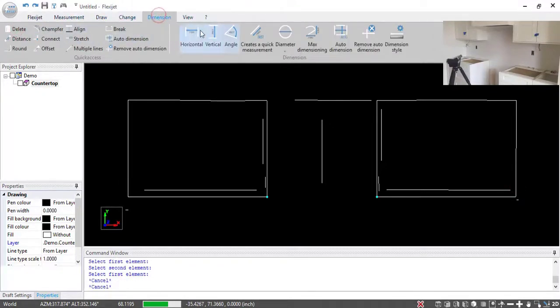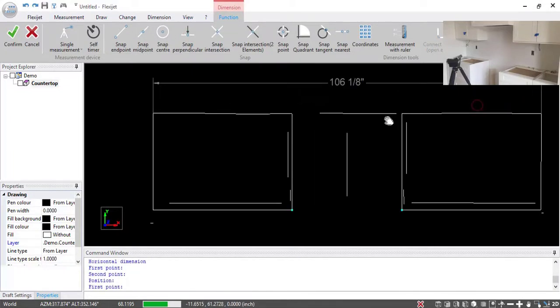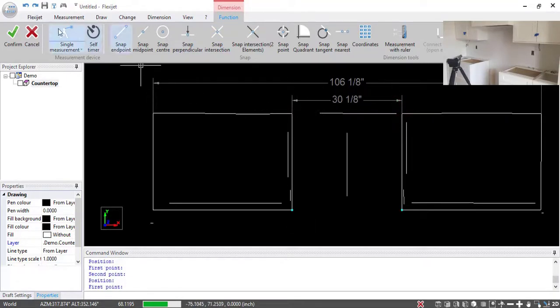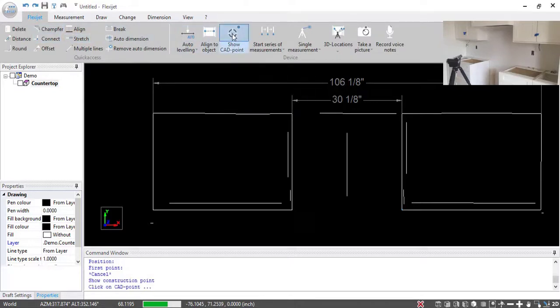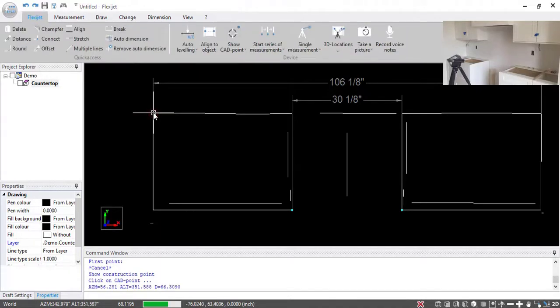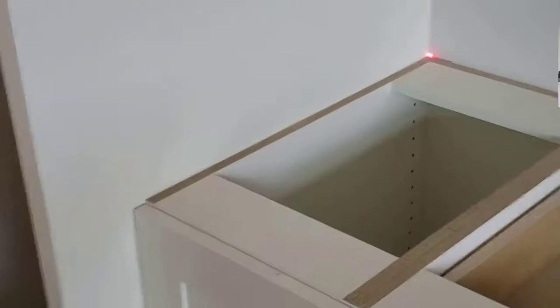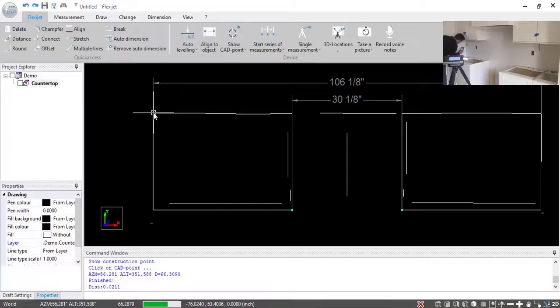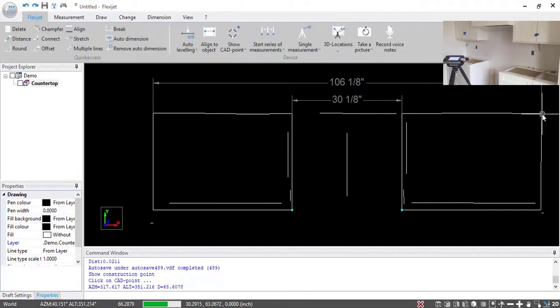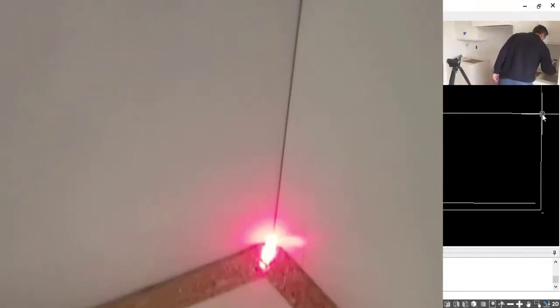So that's all looking pretty good — I've got countertops here. If I want to add some dimensions for a quick visual check, I'll pull up my tape measure and have a look. You can see my stove opening is going to be 30 and one-eighth, just like we like. But what I'd like to do is ask the laser to show me something. If I click on 'Show CAD Point,' hover over that corner — the little square there — and ask the unit to do that by clicking on it, we'll see the laser project that point right in that corner. Right at the plane I can see the laser split nicely over the three points — I'm pretty confident that's going to be very exact. Let's do that same thing with the other corner. Just watch the laser go right over to the right — walking over here, I can see that laser is dead-on.